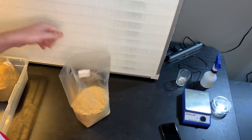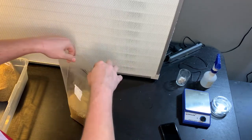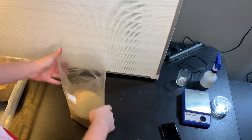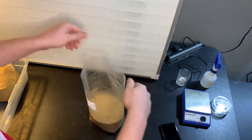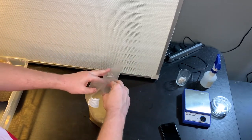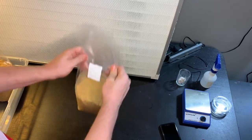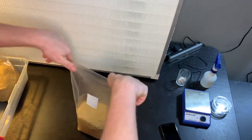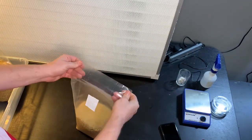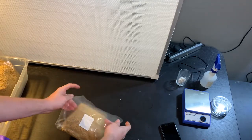For the flat fold, we're just going to pull out the gussets so it's nice and even, one layer. We're going to take care of all of the debris on the inside of the bag just like before, because we don't want that to get in the way of the impulse sealer. Normally on the gusset fold, we just simply follow along the crease. For a flat fold, we invert that crease. Push out all the air like normal, and then give it a fold.